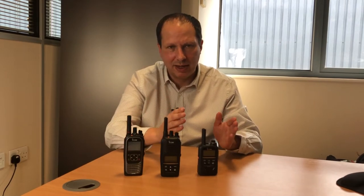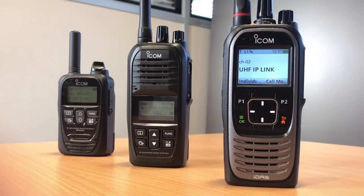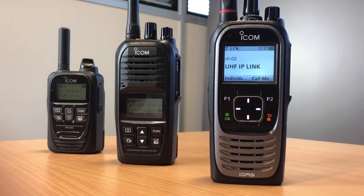So what is bridge mode? Well, bridge mode — you can think of it like a temporary repeater mode — acts as a bridge between technologies. It allows you to transmit and receive between an LTE radio and a digital PMR radio, and vice versa.